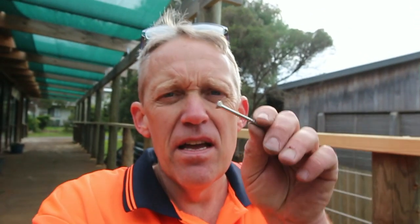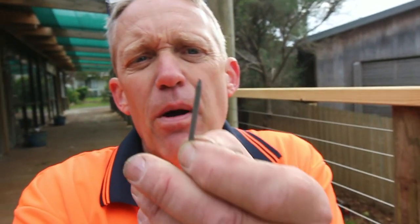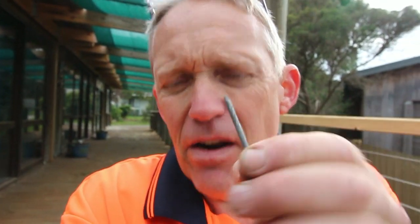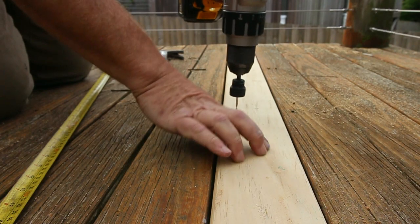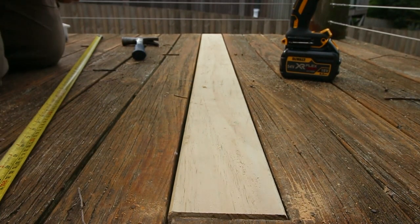When it comes to securing the timber, you have a couple of options. If you're replacing boards, go with screws or go with whatever's already in there. If it's nails, you probably want a nail that's got a twisted end — as it goes in it will spin and really grip, holding and stopping your boards from lifting. We drill two holes per joist, and that's as easy as that. The countersink drill also leaves a little countersink mark — you can buy those at pretty much any hardware shop.